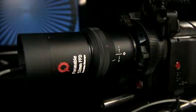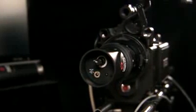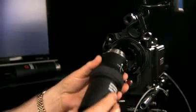Hi, I'm Peter Rapich here at Unique Optics in Simi Valley, California, and I'm about to show you a 52 millimeter flange focal distance diascope. The diascope has been created in order to inject a reticle target from the diascope to the image plane and determine whether that distance is correct or incorrect. Attach the diascope as you would any PL mounted lens.